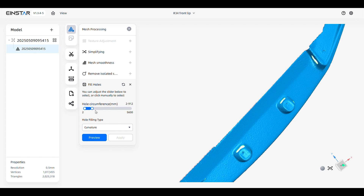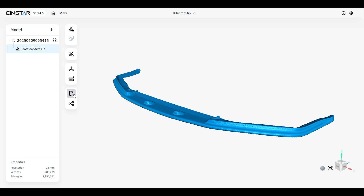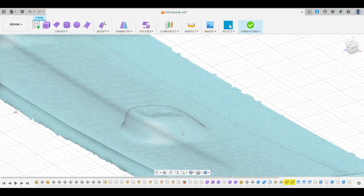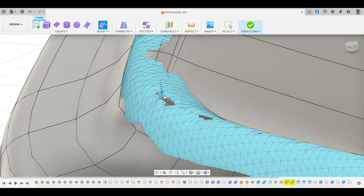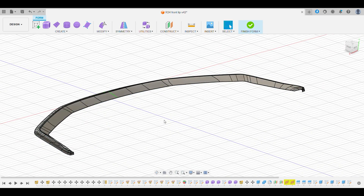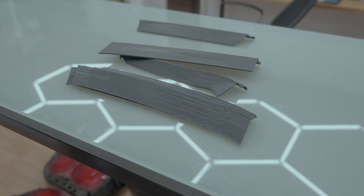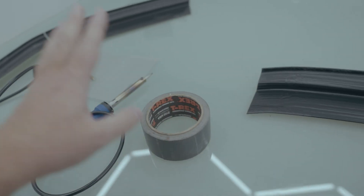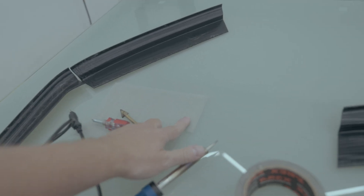There I trimmed my scan until I was happy with it and explored further options such as filling holes and smoothing the model. However, I didn't end up using smoothing because I want as accurate dimensions as possible. I then exported the model as STL and imported it into Fusion, where I went through the process of modeling a close copy and then making adjustments to the shape so it resembles what I had in mind. This took me ages because I'm not a pro at modeling and had to check tutorials. When I finally had it done, I decided to print out a prototype so I can check whether or not my dimensions were good. I split the model into six parts and printed them on my Neptune 4 Max. 24 hours later, I assembled it using tape on one side, plastic welding on the other, and added some mesh inserts.